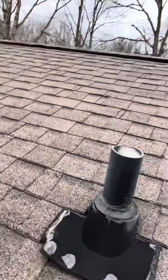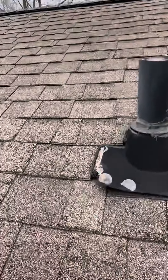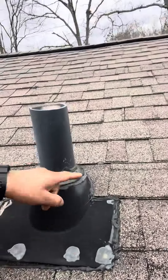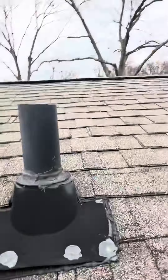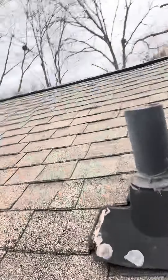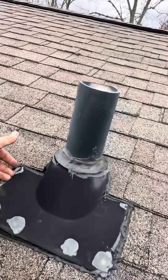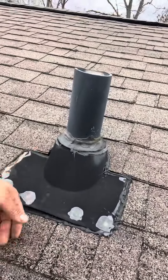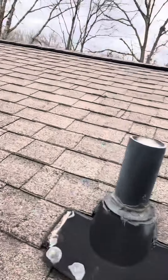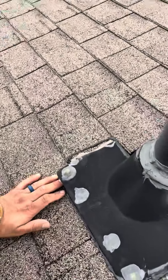As you can see, it's been repaired probably many times — lots of caulking all over, down the sides, tons of it, right up top. It does have a line of caulk at the bottom, but currently it's not doing anything. You really never want a line of caulk at the bottom, because if water gets in on the sides, you want the water to be able to come out — you don't want it trapped behind, which will definitely cause leaks.